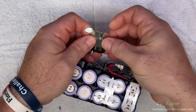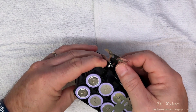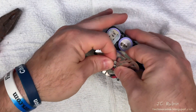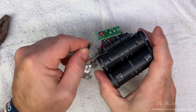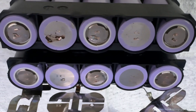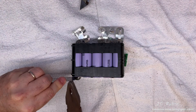With a sharp chisel and hammer this could have come off cleaner, but I wasn't really concerned. The second one came off a lot easier, ensuring I was only trying to break one weld at a time. The third one then came off quickly as it's only connected to two batteries. We've now separated an entire side.